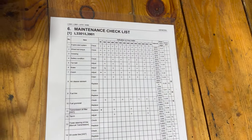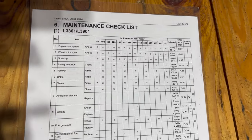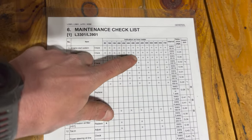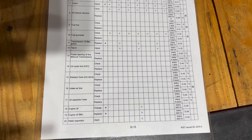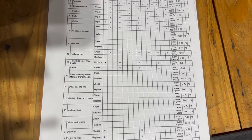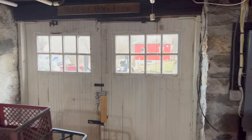So as you can see here, I have this handy checklist printed out and laminated with all the service intervals and everything that we need to do. We are going to be going down this 400-hour column and doing all these big ticket items listed with the star, including the engine oil, the engine oil filter, water separator cleaning, the transmission oil filter, and so on and so forth.